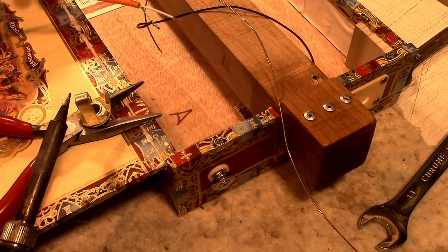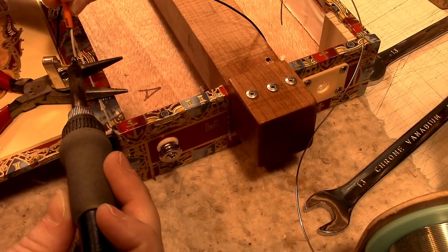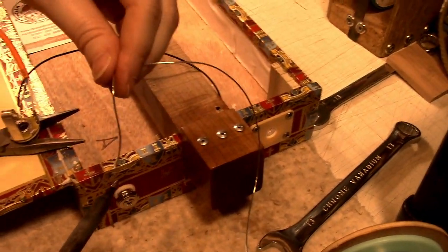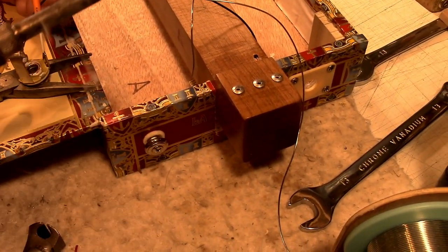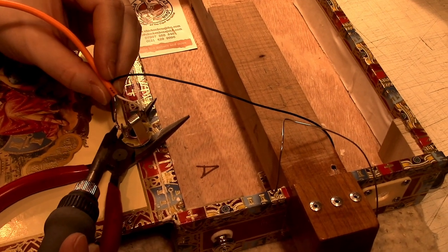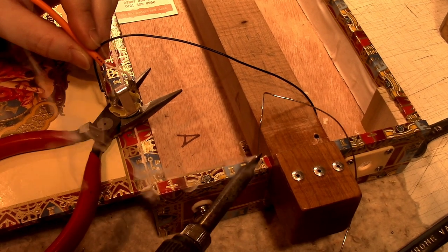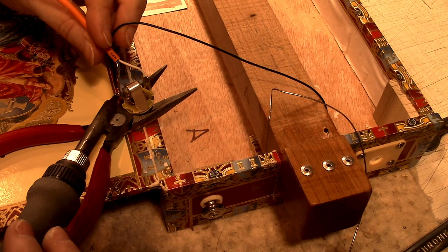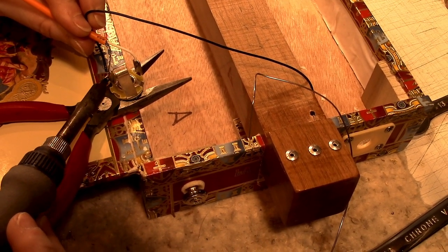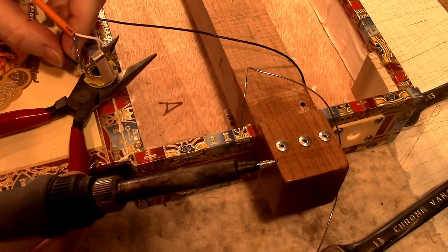One important tip when handling bare wire: use your fingers as little as possible, and make sure your hands are clean. If there's any grease on them, the solder will struggle to stick to the wire. You might have to use a fair bit of solder for this connection since it's a fair chunk of wire — you may need to triple check and even add a bit more. But always double check everything: go around, have a look, give it a little fiddle. It's best to verify everything is solid before moving on.